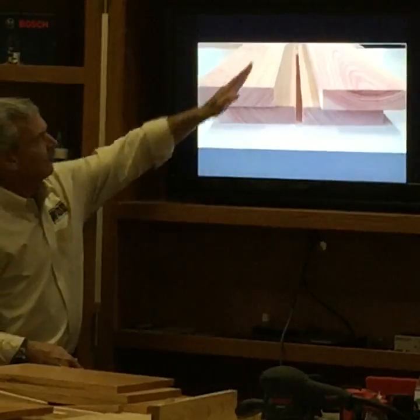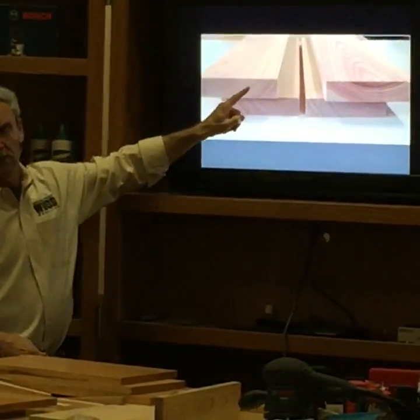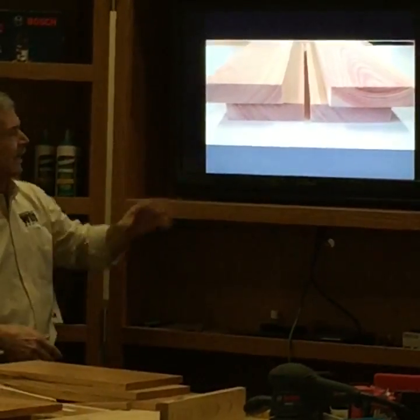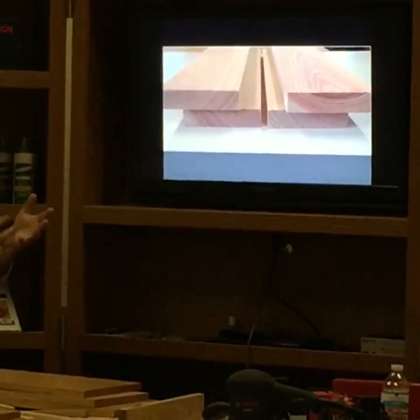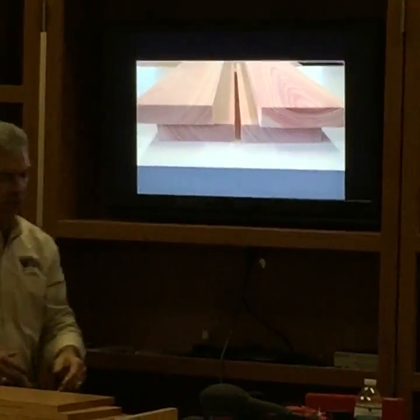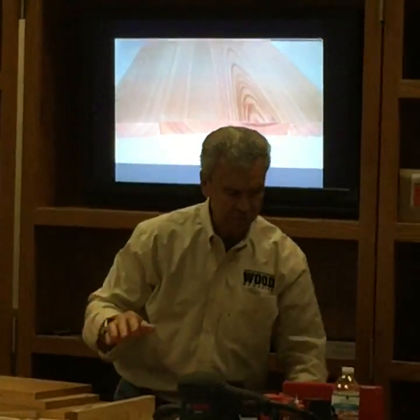This part here is a straighter grain, and this is called rift sawn, R-I-F-T. It's a little bit straighter on the outside. It comes from the outside edge of the tree. By playing with those and orienting them in certain directions, you can wind up with a much more pleasant type of glue-up. And again, I know I'm running a bit afoul of the actual glue-up part, but we'll get there. If I just glued those up, laid out the way they are, it's going to be flat. But because of all these different grain differences, it's going to be odd, okay?